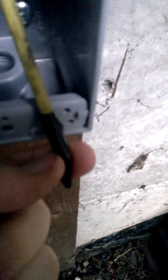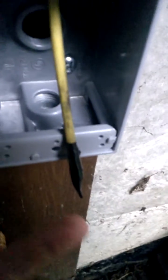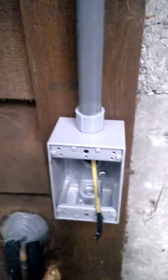So what I thought of was: if I put a little bit of tape at the end of this — the actual fiberglass fish tape ends roughly right there — I put enough tape at the end so that it would go in the hole, and as soon as it hit the corner it would fold over, like this, and it just allows it to pass that corner. Sure enough, it worked and got past the corner.